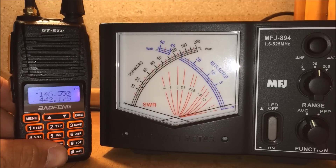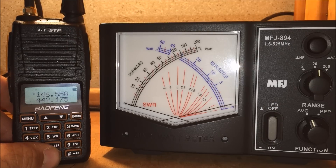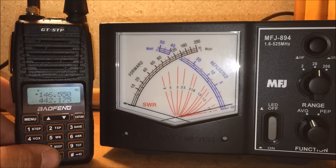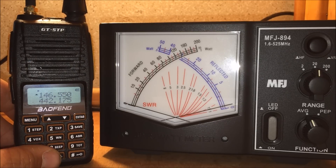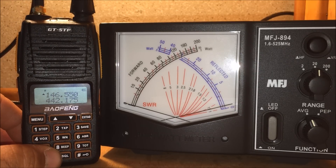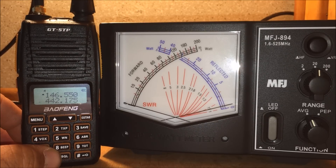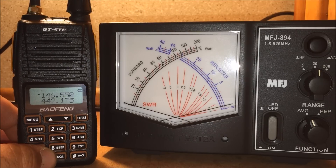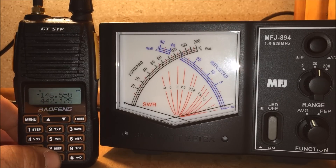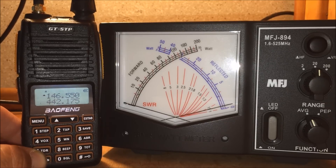Overall it's a solid radio. The key word lately has been 'up to' 8 watts, because it may not hit exactly 8 watts everywhere. Will it be better than a 4-watt radio? Yes — you need to double your power to make a significant increase, so 6 watts is better than 4. I'd like to retest with a dummy load in the future. I also want to make a video comparing all my handhelds at a mile or two miles to see which one sounds best — that'll be the most critical test. This is the GT5TP; it should work with CHIRP similar to the GT3 programming. Check out Radioddity.com for the GT5TP, subscribe and check out my other videos. 73 from KJ4YZI.